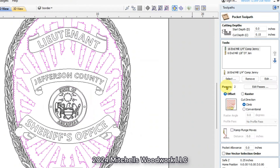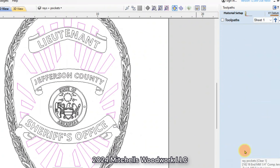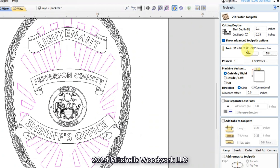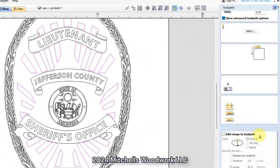Next we have what I call the dot pockets. This entire vector was cut as a pocket at 0.15 depth. Now this is interesting — I'm going to turn off the dots so it doesn't get too confusing. I use these vectors twice. The first time I cut them as pockets at 0.1. So all of this background where the dots are going to be is at 0.15, and the top of the rays will be at 0.10. So I just cut a pocket on each one of those vectors at 0.1. Then I came back and did a profile cut with the 60 degree V-bit on those same vectors at 0.05, which just put a bevel on the edge of those. Then at the end, one of the last toolpaths was a 1/16th inch end mill — a Ray Cleanup pass — just run as a profile outside the vector to clean up fuzzies.